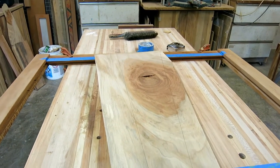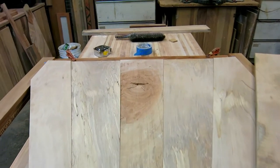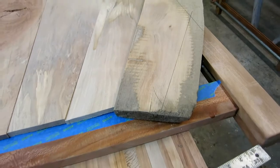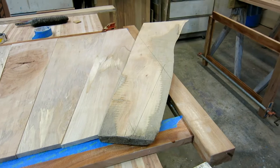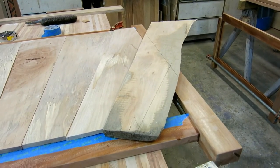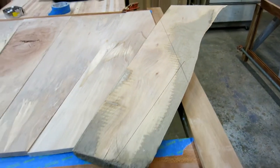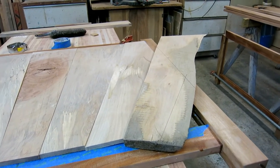I'm just hoping the knot will stay together until I get it down to half-inch thick. The panel I was most excited about — the one with the big knot — I don't think I'll use because it just looks like a big knot. They're over an inch thick and need to come down to half inch. The right way to do this would be with a bandsaw, but I don't have the right blade, so I cut them to a rough shape first to minimize planing. I've already filled up a garbage can with wood chips but I'm getting close.